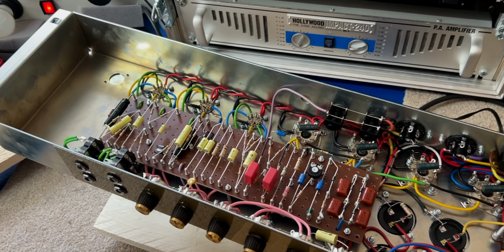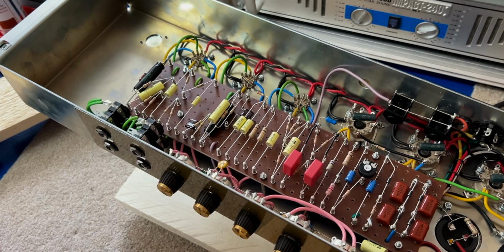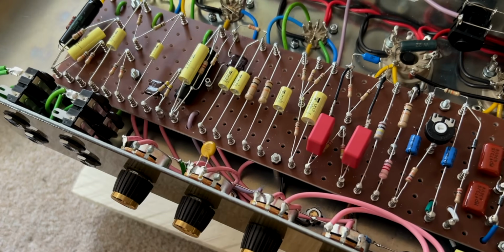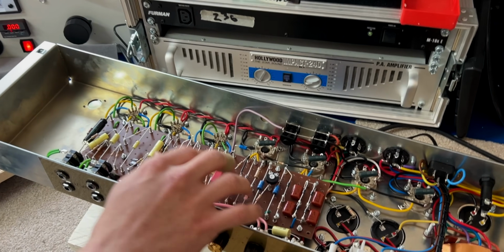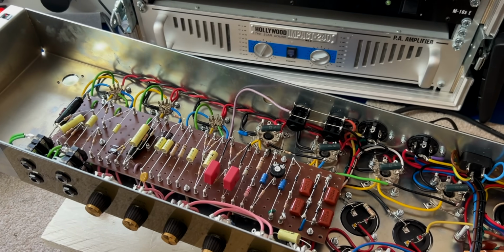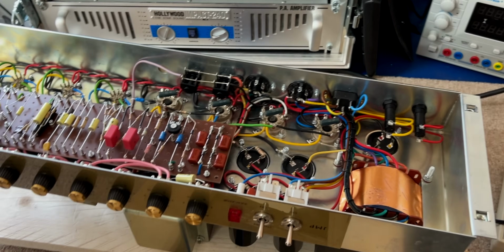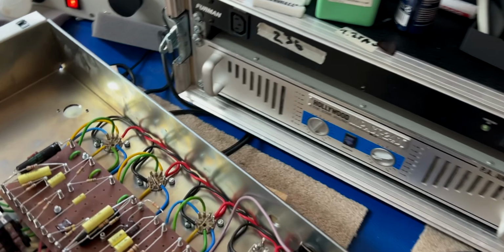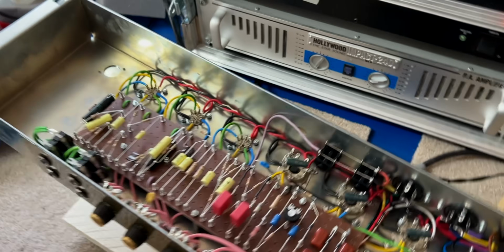And then also near the tone stack, some of the capacitors, as well as on the volume control. The bright cap was increased, it will let through more high end. And then the output coupling caps, stock it was 0.022, now it's 0.01, I believe. How about the mid part? Yes, I will have to order a new one because it's a different size. But now with the mod, it should behave the same way.